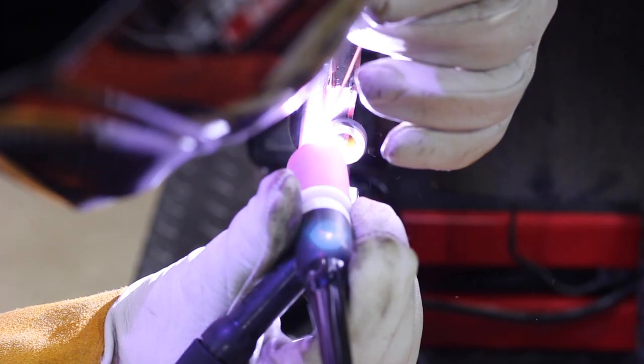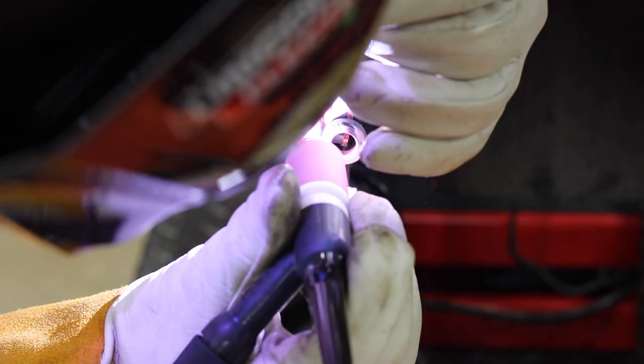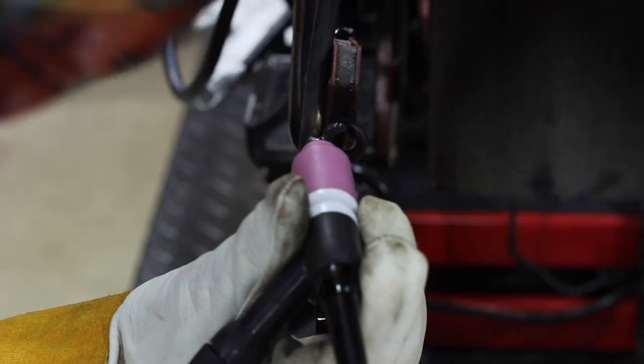In this clip, you can see I was actually using two small spacers as turn signal light holders on the fender struts of the Sportster. I've used magnets to hold it all in place. Since we're all steel at that point, I can weld them right onto the fender struts, then pull the struts off and finish weld the whole thing, since they're just tacked on.